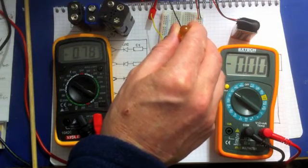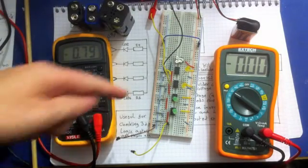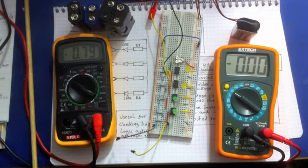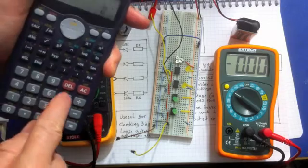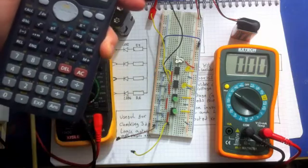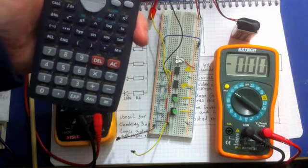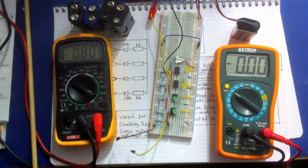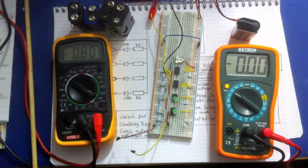And look, I've just changed it down to 0.79 of a volt, so now there would be that resolution. But if you have 0.79 and multiply that by 4, then from the bottom here to the last resistor you'd have 3.16 volts. So that would be not very good really. That's the reason I've chosen 2 volts, just so you could have a slightly bigger voltage. So you could get up to 5 volts basically for your MP3 players.